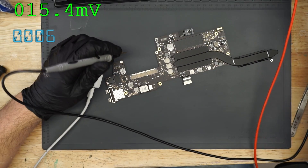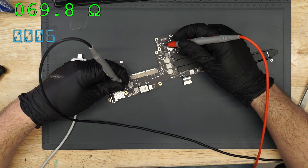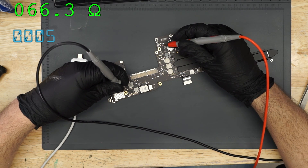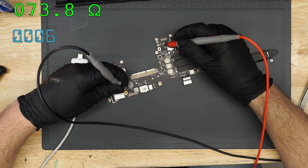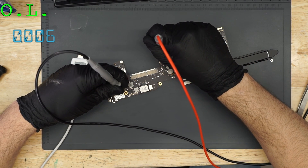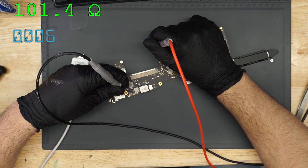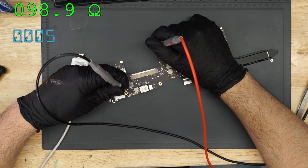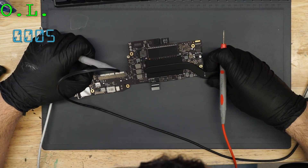We have no PP bus G3 hot here. That's not a full short to ground, but it's enough of a short to ground that things are not going to work properly. That's aggravating — it's slowly going up. Is this a short or is this not a short? Make up your damn mind. All right, I say it's a short.